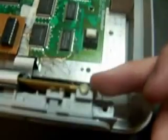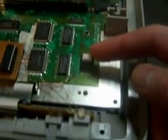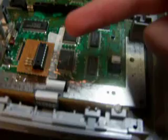So I've just had to rig it up, so I took out the original power LED from here and installed the new red, green, blue LED. I had to modify the reset switch, so obviously when you push it, it doesn't just reset automatically. The signal from the reset switch will go to the microcontroller, and depending on if we want to reset or not, if we let go on blue, it'll send a signal to where the reset was going.